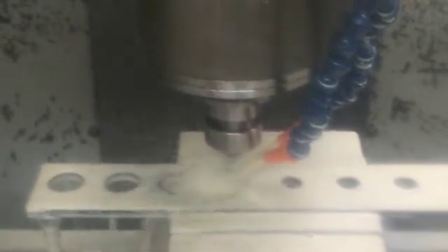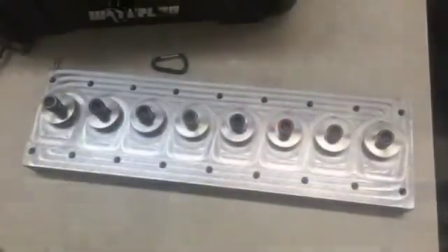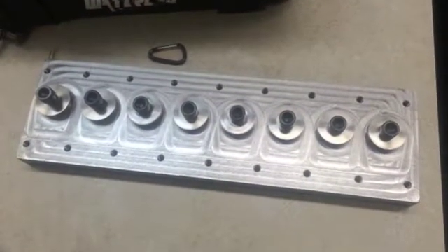Hey guys, this is Mike from Man's Gear. This is the operation for one of my recoil lugs. I bore out the holes on the stock to one inch and 66 thousandths, and when this operation is done, the stock fits on top of the fixture, is bolted down, and the contours of the recoil lugs are cut out. This is the fixture in which I bolt the stock down.